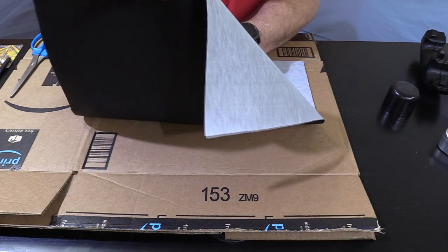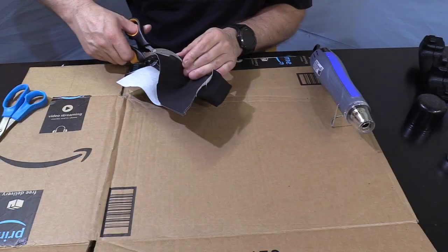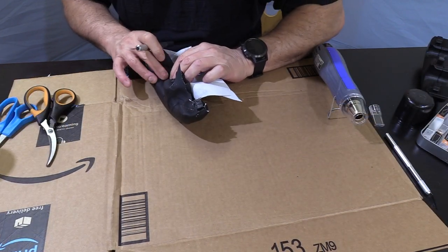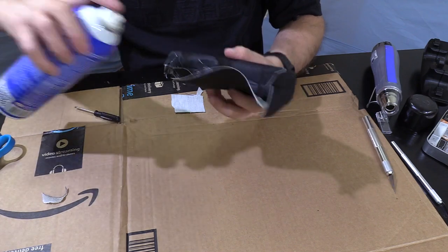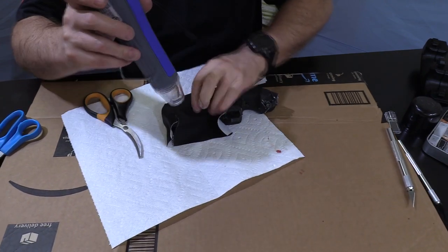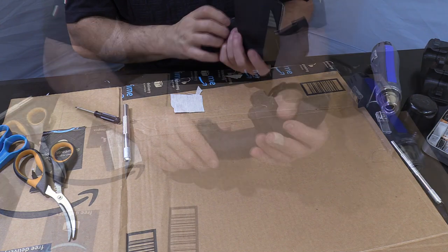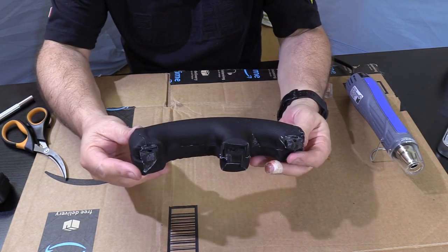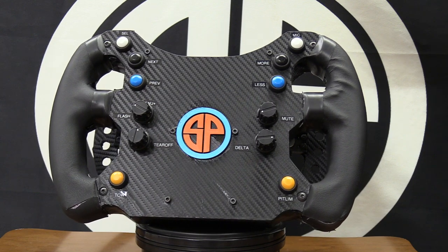The grips were being covered in a vinyl leather wrap. I cut the leather to the approximate shape and used spray-on adhesive to start attaching it to the plastic grip. Getting the vinyl to take the shape of the grip was a very big challenge - the leather has a little stretch but was harder than the wrap to conform to the curves. More heat, more stretching, and more relief cutting to make some of the handle curves. I found that too much heat caused delamination of the vinyl. In the end I wasn't super happy - I had spots missing coverage, sticky glue exposed, bubbles, and sloppy overlaps.